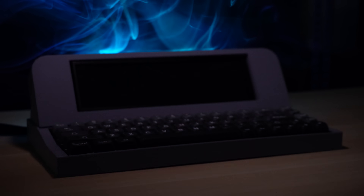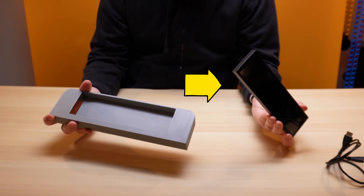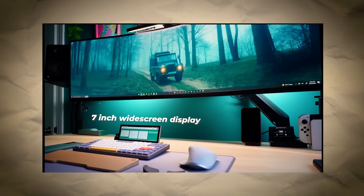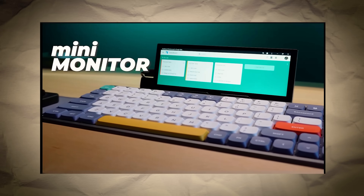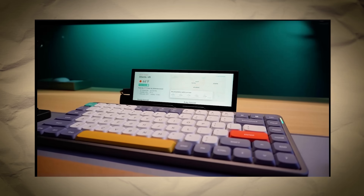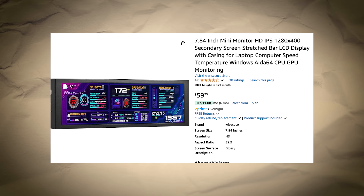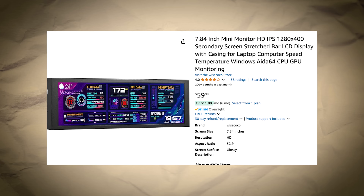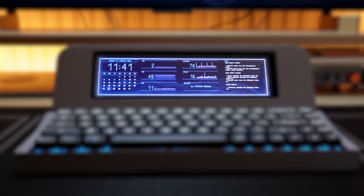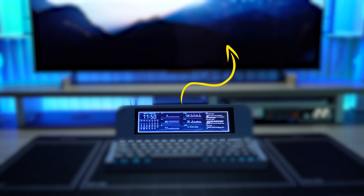The second component for this project is, of course, the screen. And luckily, I already had one. This is a 7.4-inch widescreen display — it's the same model I used for my last mini monitor video back in 2023. That monitor is actually still sold out, but there are other displays that are almost identical available on Amazon, and I'll put a link in the description. The screen resolution is 1920 by 480 — it's like an ultrawide monitor, but tiny. And that ultrawide form factor keeps the screen from being too tall and blocking part of my main monitor.